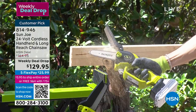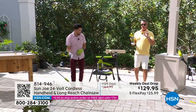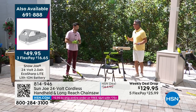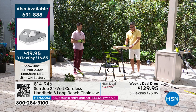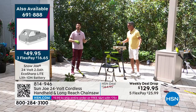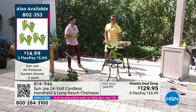Look at the control and look at the cut - look at how clean that is. A little tip: any chainsaw - and I've used big chainsaws and smaller chainsaws - the key is to get the chainsaw running before you put it on the wood. You don't want to put it on the wood and then turn it on. And you don't have to force these - I like to take my time and let the tool work with gravity.